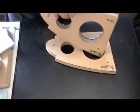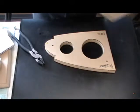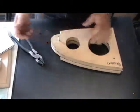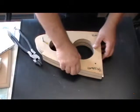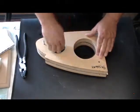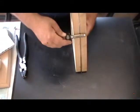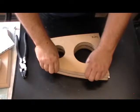So basically what you do is you sandwich the five of these, and you don't actually pin them — you use a bolt, run it up through there, and you can see we're a quarter inch long on this rib because it's a quarter inch short block. Now you've got all this excess material hanging out, no holes in it. So I take the laminate trimmer bit, put it in my router table, and run it along there using the top as a guide, and it just mills this material right off perfectly flush with the form pattern.